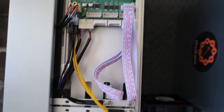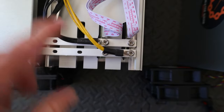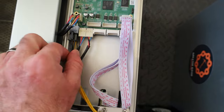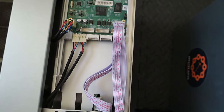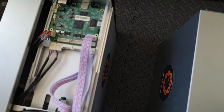But so now next thing we need to do is we need to disconnect the power from the bus bar. I'm gonna unclip everything first. I know that some of these capacitors probably have a little energy left in them. I just unplugged this thing not that long ago. I don't wanna fry anything. Don't forget the disclaimer. If you do this, you're taking it on at your own risk. You're gonna void your warranty.